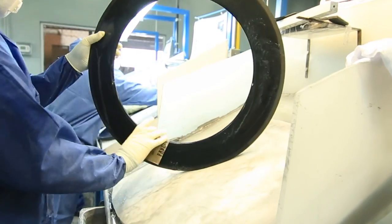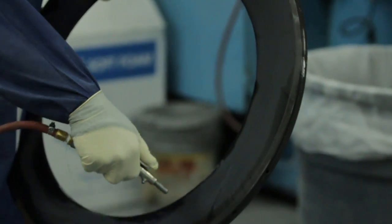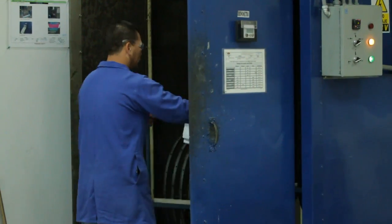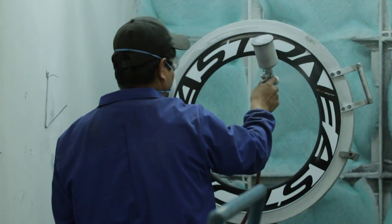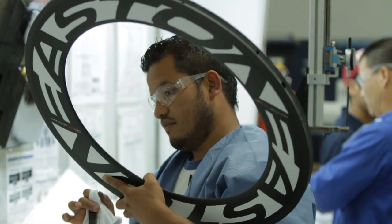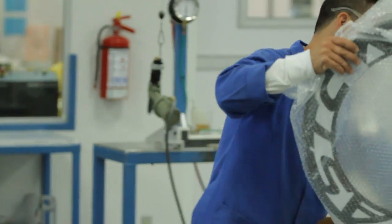The rim will then go over and get wet sanded, all prepped to make sure that as we apply the decals and finish to the rim, it's going to have the look desired by the consumer to match the high-end components going on the bike. The rim then travels to the decal room where water transfer graphics are applied — a very thin graphic, allowing us to save weight — and it gets baked onto the rim for about 20 minutes. The protective coating of that decal is then removed and a very light clear coat is applied to protect the graphics, just over the decals and not on the brake track. The brake track surface is masked to protect the water transfer graphics from chemicals or road grime. It then goes through the rim QC process: weighed once again, checked for cosmetic issues, bubble wrapped, and placed into a box ready for the warehouse or the wheel assembly area.